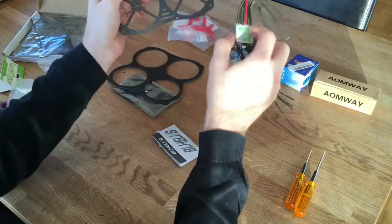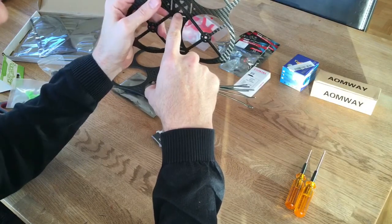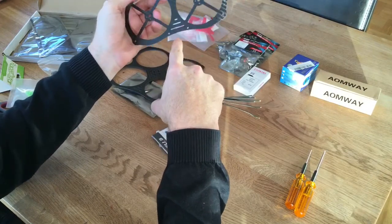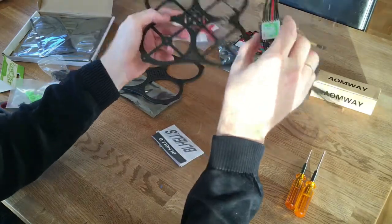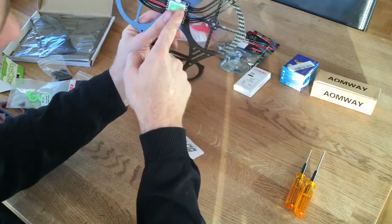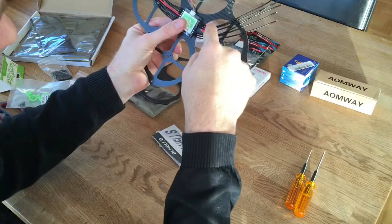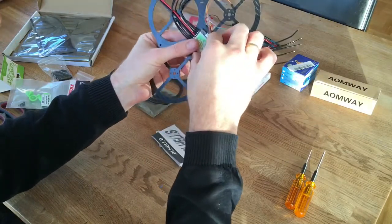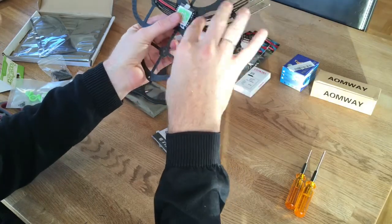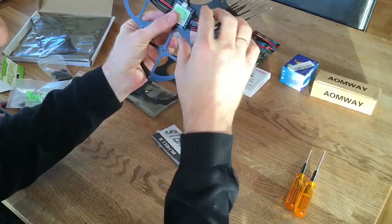As you can see, they fit directly in the holes of the center here. I think you can have this in 110mm, but I like the 130mm size because this makes it possible to have no problem with the mounts in the middle, and the propellers will not touch the components like they would if you don't take some very special precautions when building a 110mm.